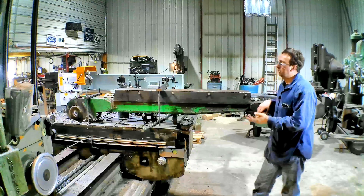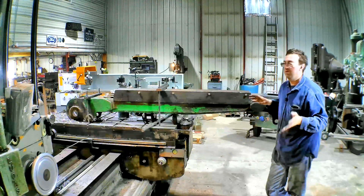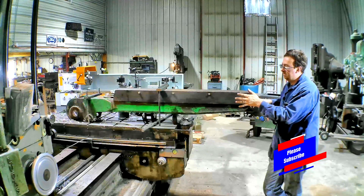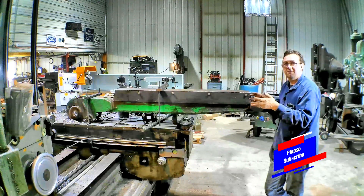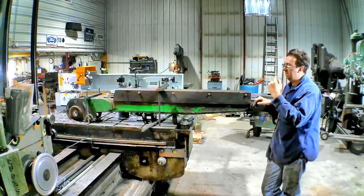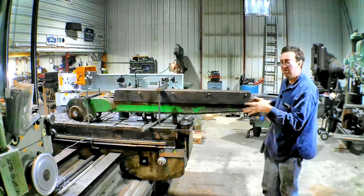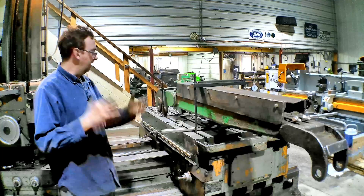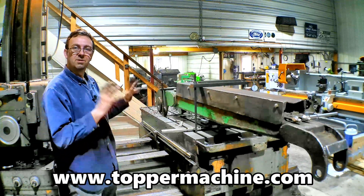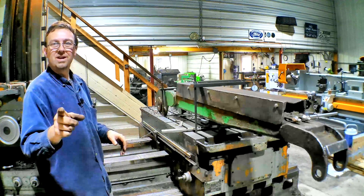There you have it, another line boring job on the books. It bored up really nice. I made some nice new tooling and fixturing, it worked really well this time, and I'm very happy with the outcome. Now I'll make up some plugs that will go inside there — with a chamfer on them, they'll just tap in nice and they'll be snug, weld them up. And if this ever fails again, we just grind that weld out, pop those out, put new ones in, weld them back in. Pretty simple, easy fix. Those plugs do get a bushing in yet besides, so we don't have problems there. Since I'm so far behind here in the shop, I'm just going to end the video here. You know how I'm fixing it, you know how it's going together — but you wanted to see the line boring, and that's what you were after. So get out in your shop and get it done right the first time.